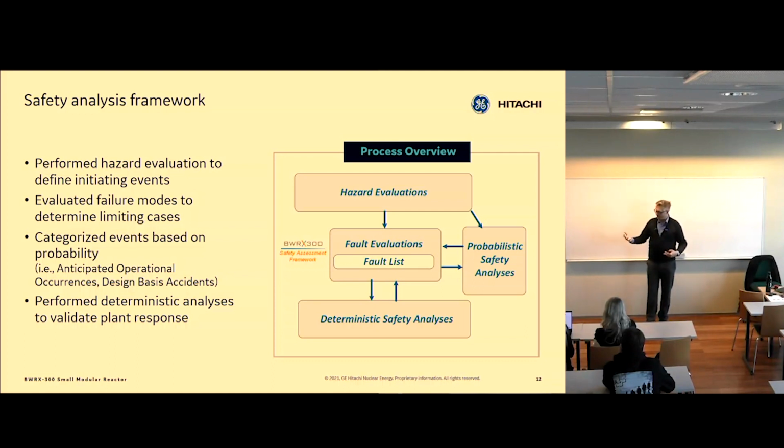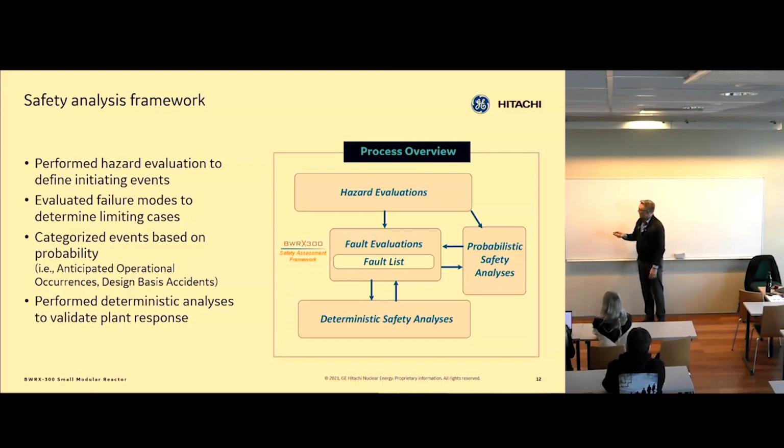But then they know, I have to measure level, but why? Because you have a safety class, you have a Defense Line 3 function to scram on low level. Okay, that's safety related. That's really important that it gets done right. So by having this system in place, the system engineer that gets the functional requirement to measure level can easily go back here, or he can ask too, or she. But typically, this is very transparent and open to everybody. They know why that indicator is there and what the safety pedigree of that indicator is and why they have to have it in their system.